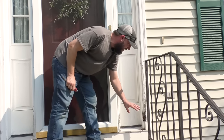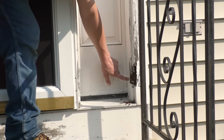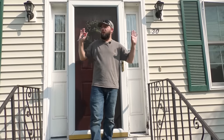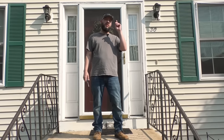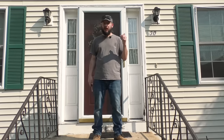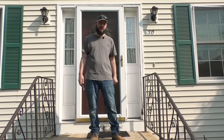There's a little bit of damage on the other side, but it's really not as bad. This piece of trim right here is no big deal — taking that off and putting a new piece on. This part is a little trickier because it's actually part of this door. So instead of replacing this entire door, I'm just going to patch this in so we can save a bunch of money. You may have noticed some staining on the front of the gutters up there, which means it was overflowing, and that could also contribute to this problem in the future. That has been fixed, so now I feel comfortable fixing this without having to worry about it again anytime soon.